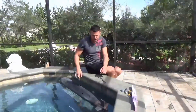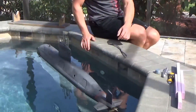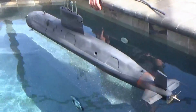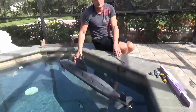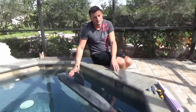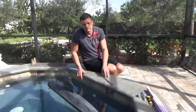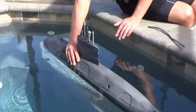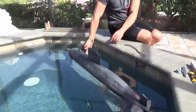Water is entering the sub hull through those openings in the bottom. Surprisingly, it looks almost bang on at the rear, but it's sitting about an inch and a half high in the front — telling me I've got a lot of extra foam up front that I don't need. I can either add weight to the bow or take foam out of the bow. Ideally we want it sitting right at the waterline, so I'm going to pull it out, open it up, and remove some foam from the front area.